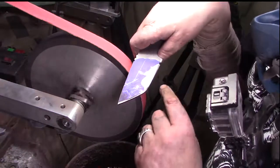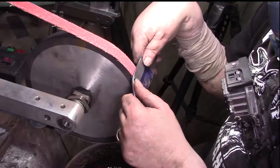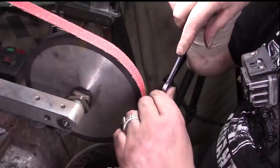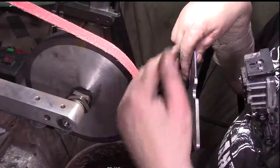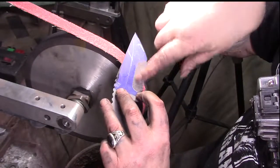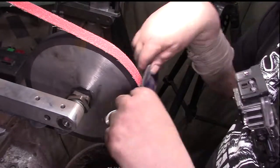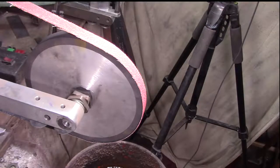Now I don't know if you noticed, with these grinds, I'll hang the belt over this way to get here, and then move it that way to go here. Flip it over and I'll start on this side because the belt's hanging over, then I'll move it. Because you gotta move it back and forth for each side so you can get that look and get that evenness. Because when you don't, it'll cut right into there. All right, there, my air freshener went off, hold on.